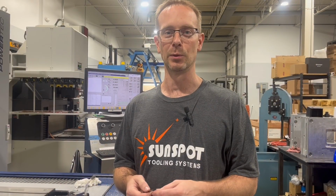I'd like to ask the viewers how they make electrodes. Do they double end them if they can? And sometimes you can actually do a 4-quadrant electrode to save on carbon and setup and accuracy. So that's a good question for the viewers. On this particular burn, we only needed 2 electrodes. My question to everybody is, how many did you have to make on your machine?